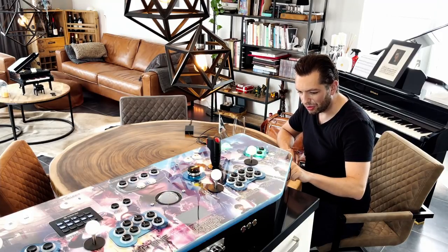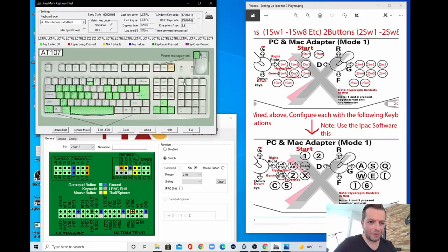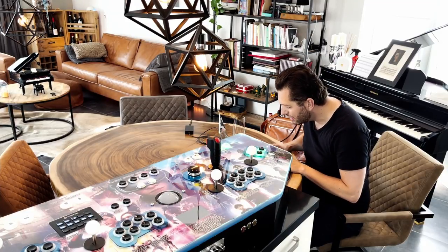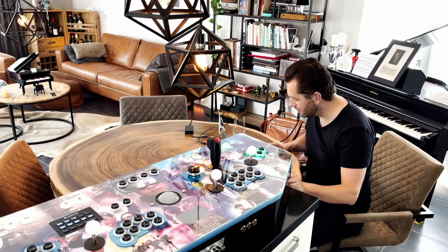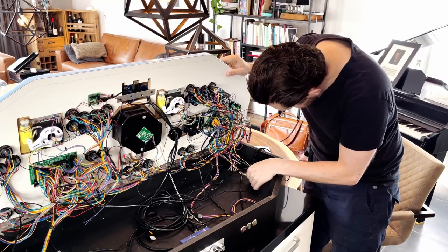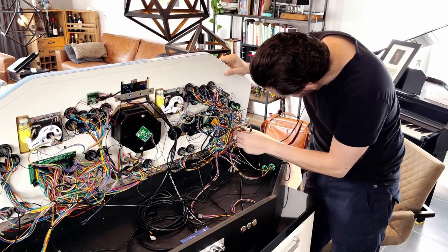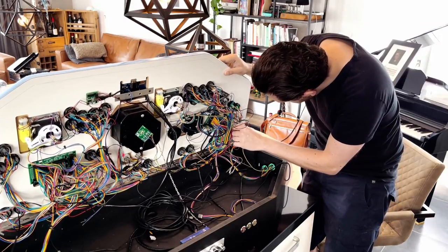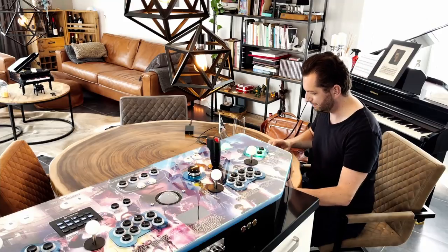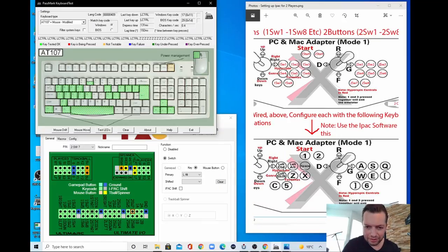Let's see here. I do have two pinball buttons, and they are mapped to left control and Z. And let me check for pinball. We want the right pinball button to be, I think, player 2 switch 1, which is an A. So this control, we will be taking a look where it is connected. And it's the yellow one. Actually, it's connected to player 1 button 1.